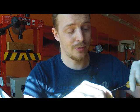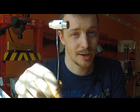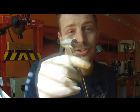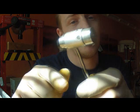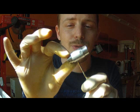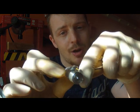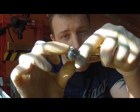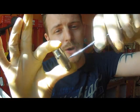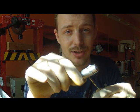My personal preference to guarantee no failures through contact is to take the extra time and turn a jig. I'm not a believer of hanging on wire — it's asking for too many things to go wrong. With the time we spend making our pens, you may as well spend an extra 20 minutes turning a proper jig. I take an old scrap piece of aluminium, turn one end down to slide the cap onto, and the other end for the pen body. I drill a hole for the finial and another hole to push the aluminium welding wire into.